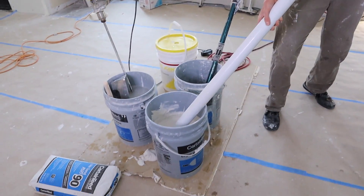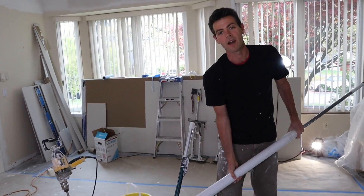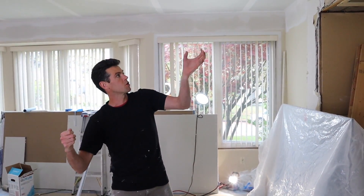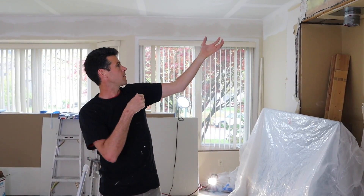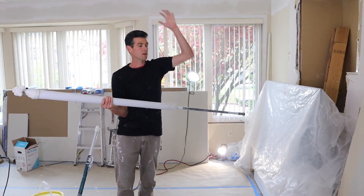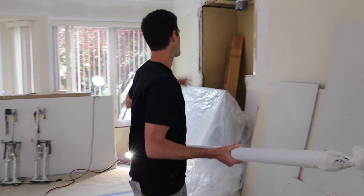I just dunk this guy in here. The basic principle behind this is like an accordion — when you're pushing into the ceiling and pushing on one arm, there's going to be a lot of drag. So when you run around this room, you kind of have to pull with one arm and push with the other. The amount of mud you get in here is critical because if you get too much it drips all down the wall, and if you don't get enough it doesn't feather the edges. Hopefully I can get it just right in one pass around this room. This is nine-foot tall ceilings — I can quite easily do this just standing here.